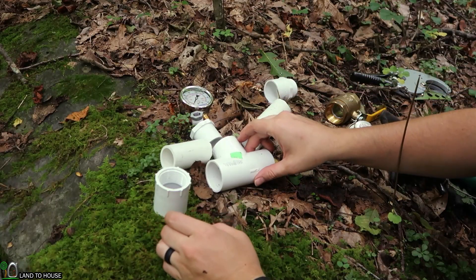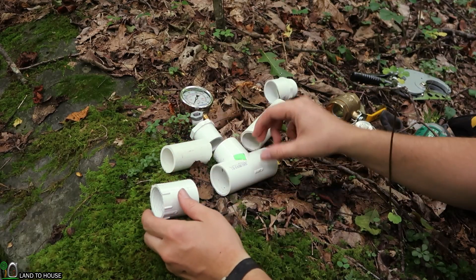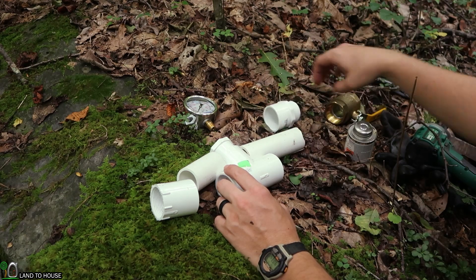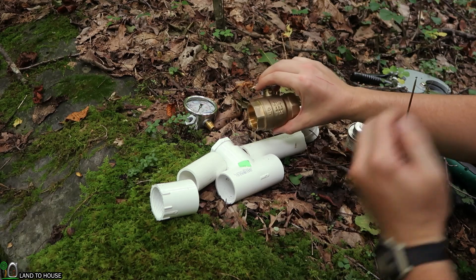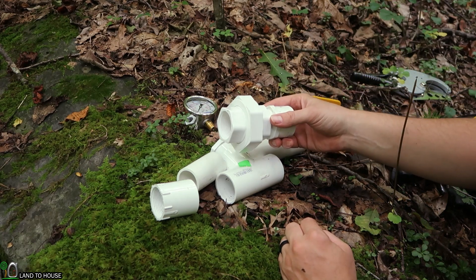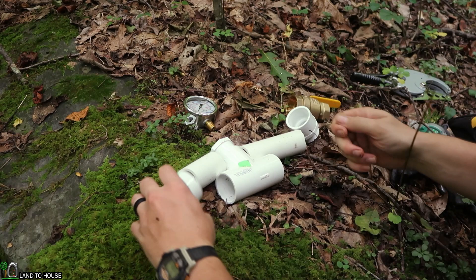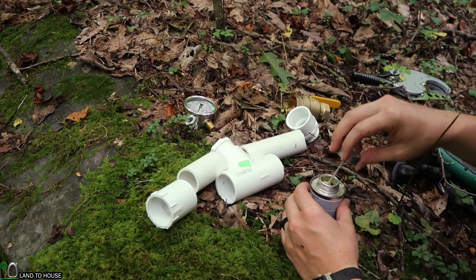This is what it's going to look like down here at the end of the penstock. This will attach to that barb fitting on the penstock there. I have this piece which goes up on a T for the pressure gauge. Then we'll come out over here to another one of these brass valves like we used up top, so we'll be able to cut the water off. And later on we're going to use a union to attach the turbine so that if we need to do some maintenance we can just pull the turbine off easily. So I'm going to go through here and just get these fittings glued, give it a few minutes to cure, and then we'll get a pressure reading.